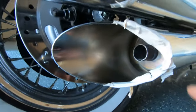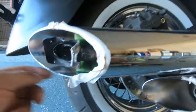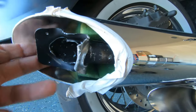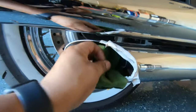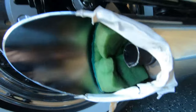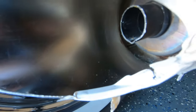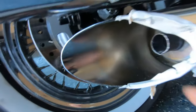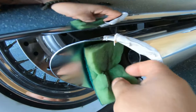So I finished the first pipe. There's a little bit of a dent, not too bad — because I got too excited, I twisted it. But one thing I forgot to mention: get yourself a regular dishwashing sponge and put it just behind that pipe while you're scraping it, so you're not hitting the back pipe. The last thing you want to do is mark your back pipe. You can see just a little bit of glue here, but it's not too bad — you can't really notice it unless you really look. But if you want this to be silver, I highly suggest putting the sponge back there.